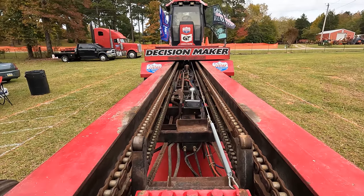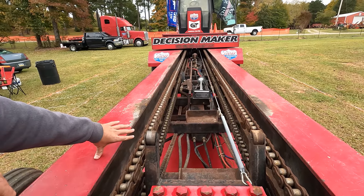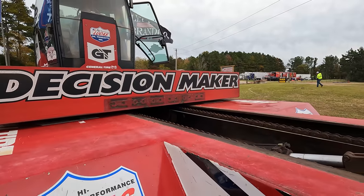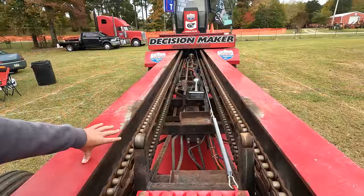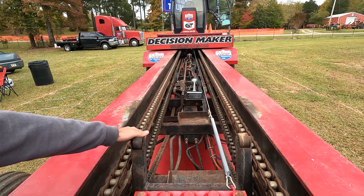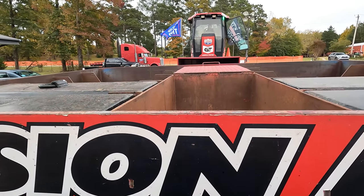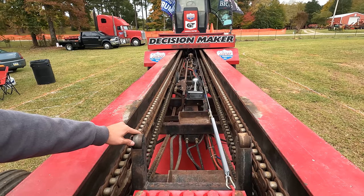In here you can see a majorly heavy-duty bicycle chain. That's a 140H roller chain that drives the box forward and backward. This arm here with the rollers — the box hits that and pulls it forward, which will kick the box drive clutch out of gear as well as activate the push-down hydraulics on the back of the pan.